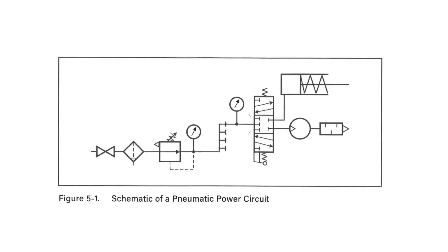You can see where we've got the regulator built in, and of course that goes in with the pressure gauge, then to the main manifold. Once we come out of the manifold we plumb in our own pressure gauge that we can look at here on the trainer, and then it goes into our directional control valve. This directional control valve does two things.